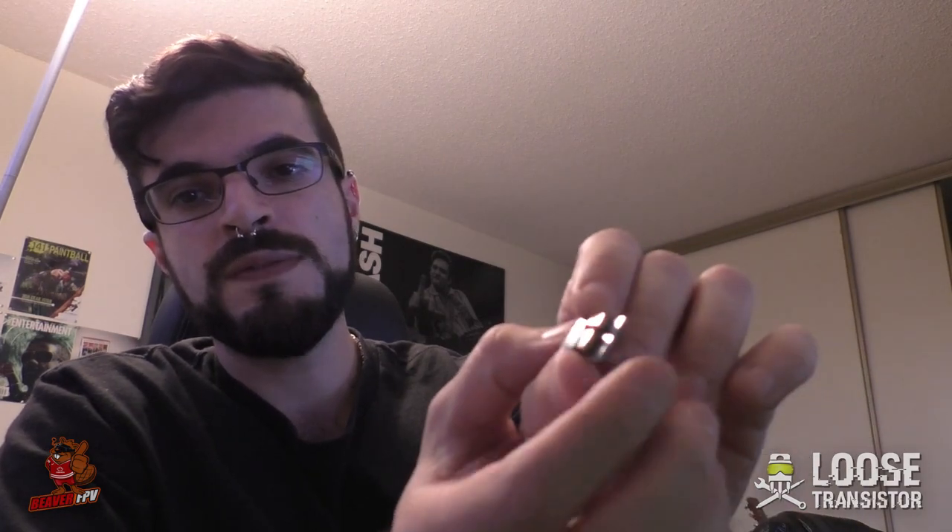One more thing — this right here is a Ready-To-Fly Quads RTFQ LC filter for your quads. I wouldn't necessarily put this on a tiny 3-inch, 2-inch, or micro, but a 5-inch, 6-inch, and definitely a 7-inch — it's just an LC filter to keep nasty lines off your video and keep it nice and clean. I bought a bunch of these and I'm going to be retrofitting some of my builds and posting DVR so you can see the effect.